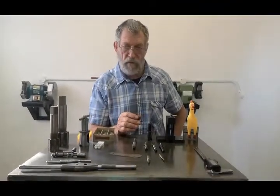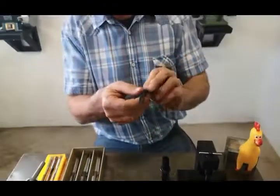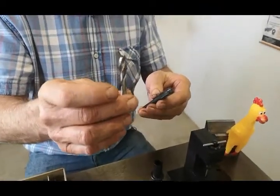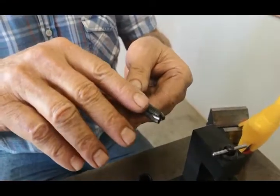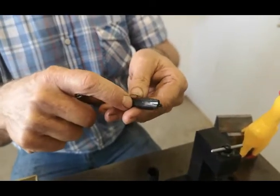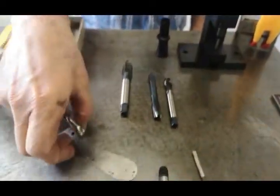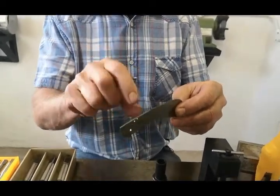The next thing is machine taps. Here's probably the most important thing that will affect most of you. This is what we call a spiral point. People get confused because when we say spiral point, they think we're talking about a spiral flute tap. The spiral point is at the front of the tap — it generally has a straight flute, or a very slight spiral in some cases, but with a little spiral on the front. When it enters the hole, it pushes the shaving forward. So if you're tapping a through hole, it pushes the shavings out the way. For knife making, generally working with liners going through — you want a tap that's going to push the shaving forward. That's your spiral point.